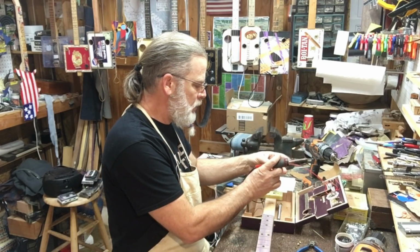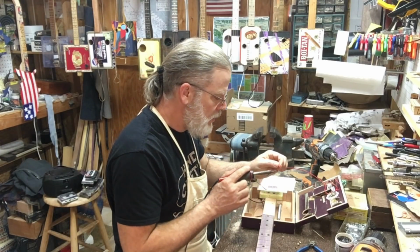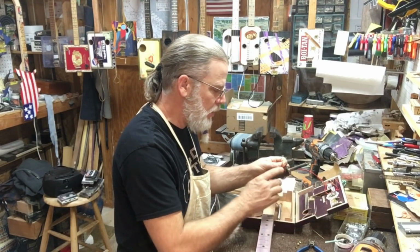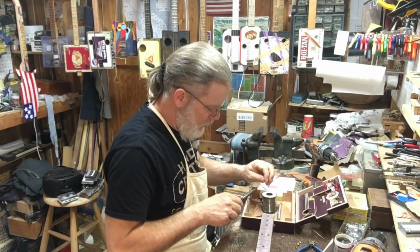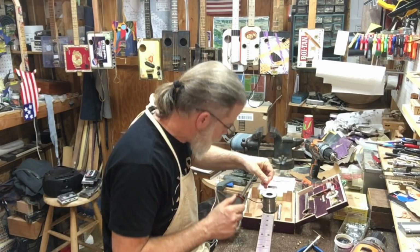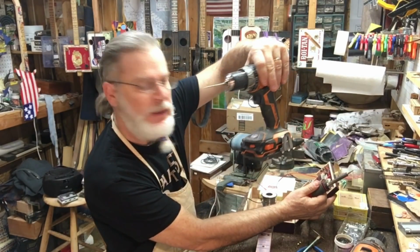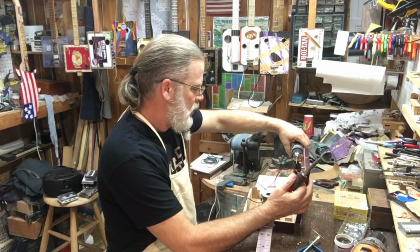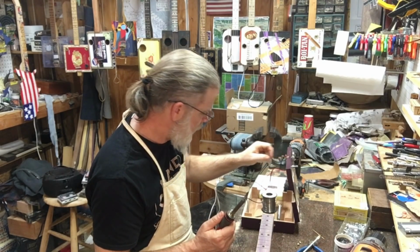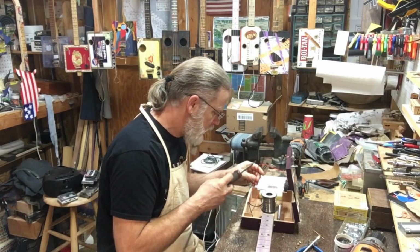Okay, so I'm not gonna do the ground on this side yet, because I'm going to tie all of my grounds together. Hey, look, I forgot to tin this guy. Slacker. Okay, another little trick is I get my drill and I set my drill so that I can kind of close this guy without it closing down. It stays open because it's resting on the drill bit here. And then this way I can get the wires a little bit closer without it falling over on me.